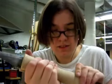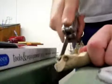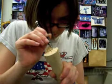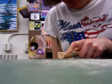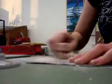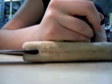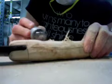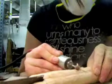Once the tang fits, it's time to cut the grips into the shape we want — again, it takes a lot of measurement and cutting. Once we're sure of the shape, we use epoxy to glue it to the tang. We plan for the grip to be wrapped in leather, so we have to hollow out the middle a little bit more so that the leather will fit in properly. This will also add some nice angles to the grips.